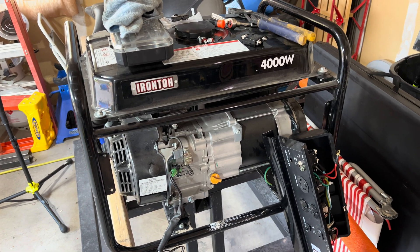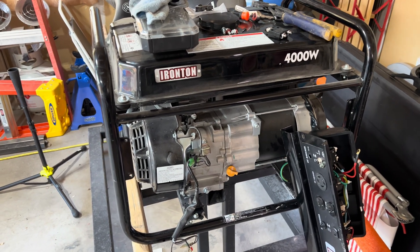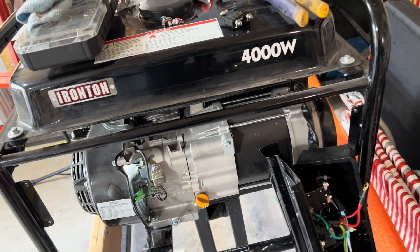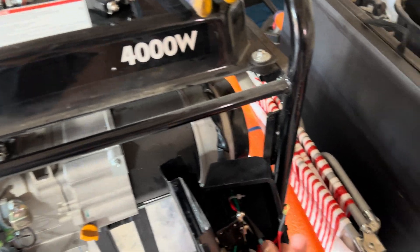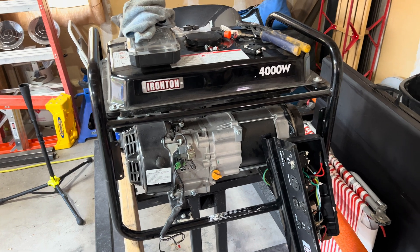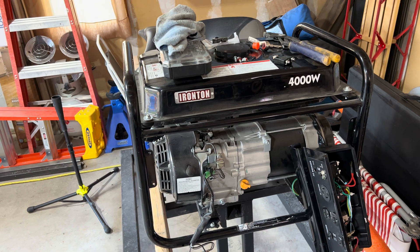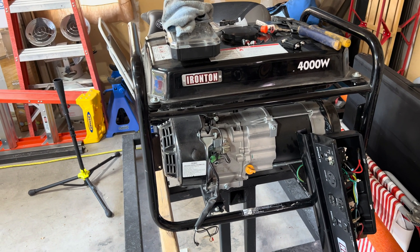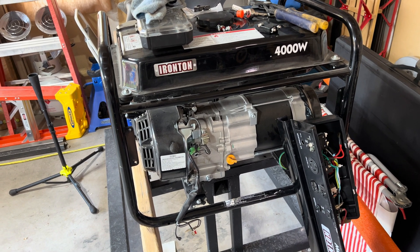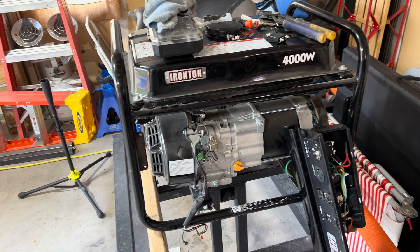I know from running this on my house, going to a 20 amp will be no issue because my camper runs all day on a 20 amp breaker. You're talking really short leads going to here, so there shouldn't be any problem with the wire size or this generator being able to handle that. Do your own research and proceed at your own risk. If you're looking to do it, it is very simple and pretty cheap. If you guys have questions, let me know — I'll try to link these down in the description. We'll catch you all in the next video.